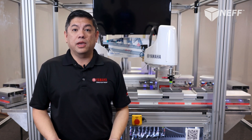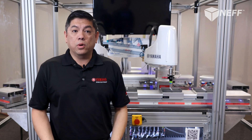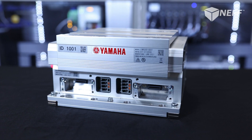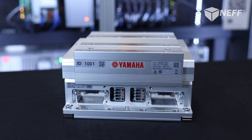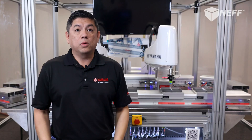This is probably the number one question we get asked. The servo pallets move around the system via magnetism. The LCM is basically a flat motor with the magnets mounted on the pallet and the stator coils of the motor are powered on a fixed module by 48 volts DC. Multiple pallets and modules make up the simple construction of an LCM conveyor. Mechanical engineers can literally Lego the conveyor system together. Modules are available in different fixed lengths — 200, 300, 500, or 1 meter long. You only need to mount the modules down on a precision flat surface and connect your 48 volts DC power to the bottom of the unit.